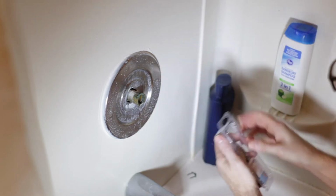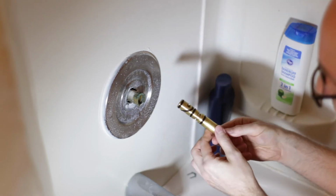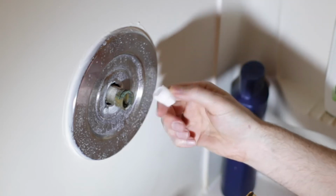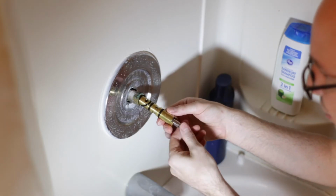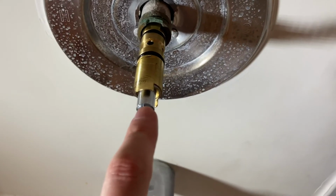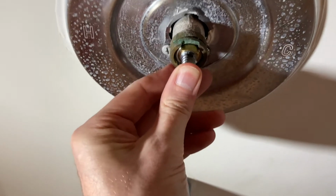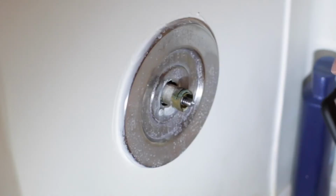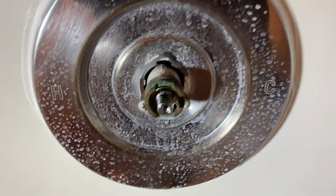All right, so you'll take your cartridge out of the container here. And one thing you'll notice is in your package, it'll be pre-greased for you, it'll come with this little tool. And sometimes you can use this to dislodge it. So you may want to try this piece first before buying that puller. But what you'll do is take your cartridge with the hole facing up, and then you can just push this right in. Like so. And if you need to, you can use this little white guy to help push it in place all the way. Okay? Pretty awesome.